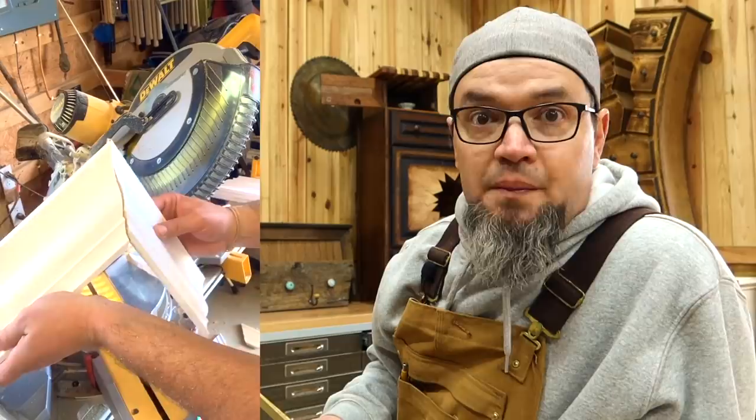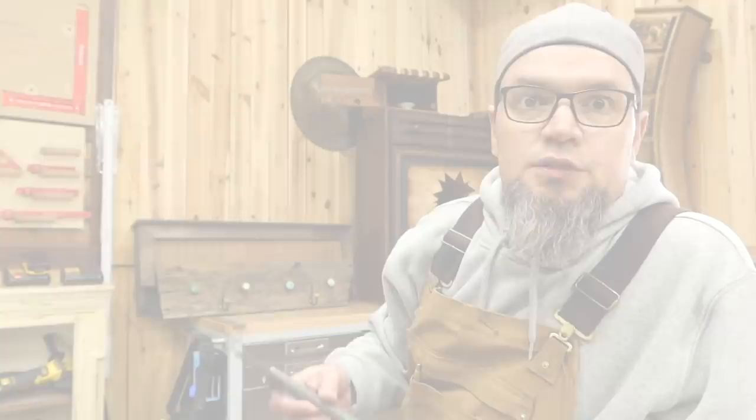Probably one of my most viral tool tip videos was on how to cut crown molding flat. A lot of people don't realize you can cut crown flat — you don't have to flip it upside down or cut it backwards. Have you ever wondered what those extra numbers on your saw are, like the 33.9? If you have a compound miter saw, you can cut crown flat by beveling your saw to 33.9 degrees and turning your miter to 31.6 — both numbers are already stamped on the plate. The 22.5 is for baseboard. All kinds of information is on these saws if you take the time to read the manual. It's a little sketchy cutting compound miters if you're not used to it, but it's another method to achieve the same goal.